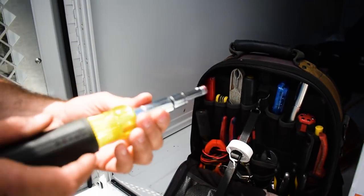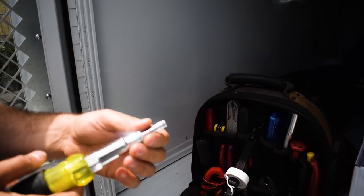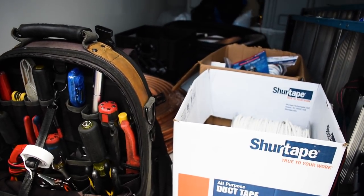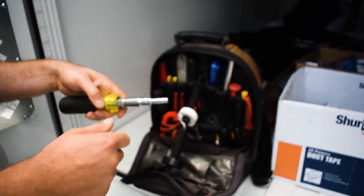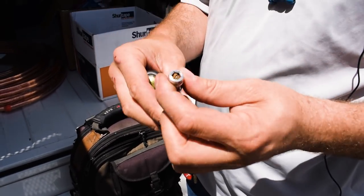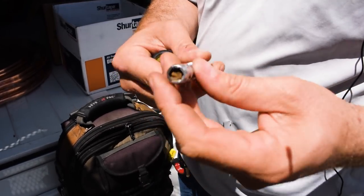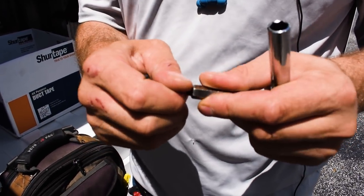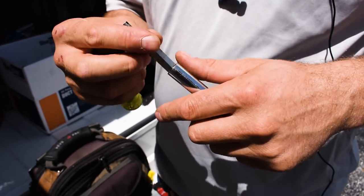This is kind of cool — I just got this. It's the multi. It works good as a backup. We have all the different sizes on there, goes up to like nine sixteenths. It's come in handy a few times, especially on blower motor belly bands. You can get this on there and it'll stay, rather than trying to do it with two wrenches — put this on one side, socket on the other, and pull it right off. AC eight-in-one. I love this thing. You've got your quarter inch and five sixteenths — both magnetic — then three eighths, a core remover, locking caps, thermostat sized, and of course a Phillips and flathead.